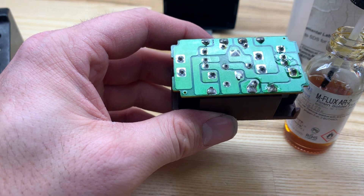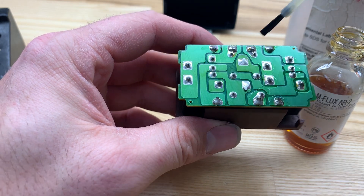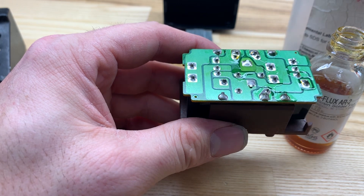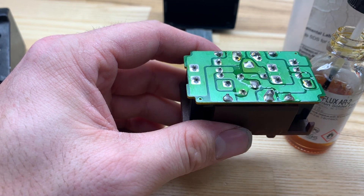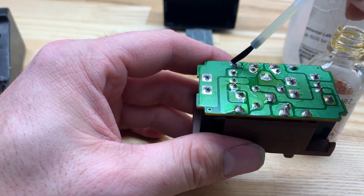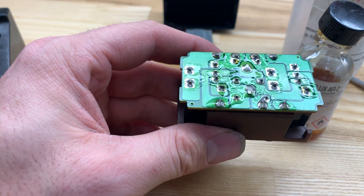What this is going to do is help the solder flow — it is very useful in soldering. I recommend always fluxing whatever you're going to solder. I don't care if you're just soldering two wires together, I flux the heck out of it. Just kind of get all your connections wet. It's really sticky and hard to clean off, but it's not going to affect anything if you get too much on there.